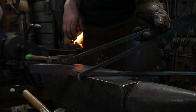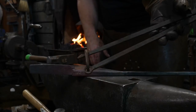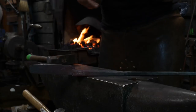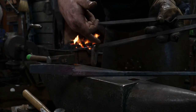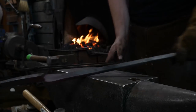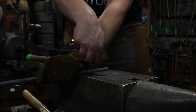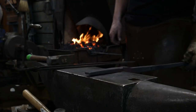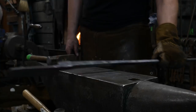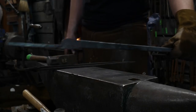Yeah, you're fine. I'm going to give these their very own tong clip handles. So these are going to be made this way. I've decided I'm going to make all of my tongs this way, but there's going to be a slight variation in twists. In this style, I just looped it around, but with these tongs, I'm actually going to slit and drift a hole in the end of the tong for the tong loop, for the ring. Depending on time, we might weld all that up. You have to do that before you put these things together, otherwise it becomes a real big pain in the butt. So you have to do that while these are apart. That's why I said these won't be finished tonight, but we'll get them mostly formed.